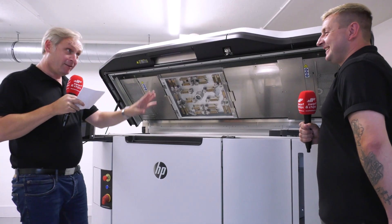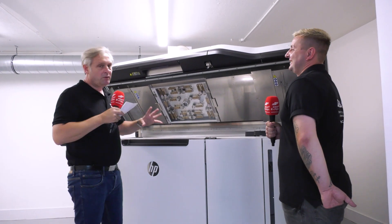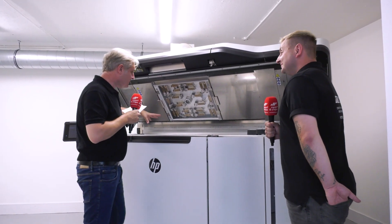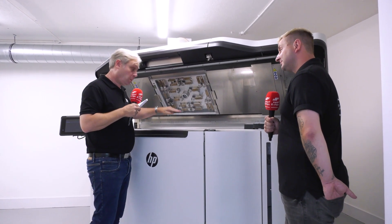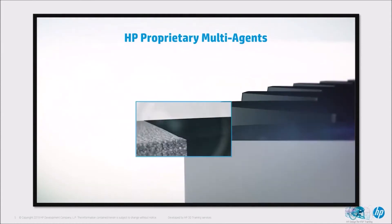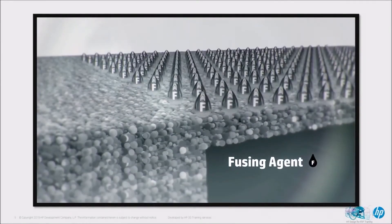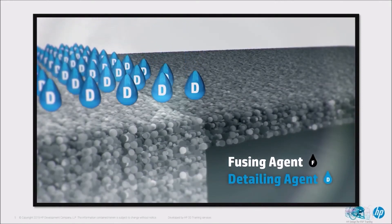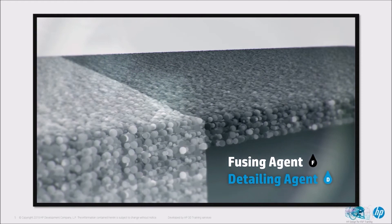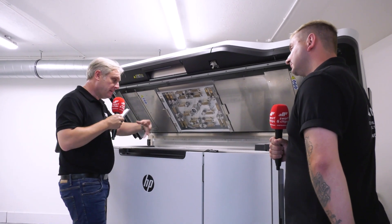And this is isotropic. What does isotropic mean? With different styles of 3D printing, in the X and Y it's fairly rigid, but in the Z it's not. But with isotropic it is, because it's actually fusing the powder together, so it's building a lot, lot stronger. You've got all the different components in there — you can have one component or, depending on the size, hundreds of components. The software will work it all out and build and fit everything in the best way within that working envelope.